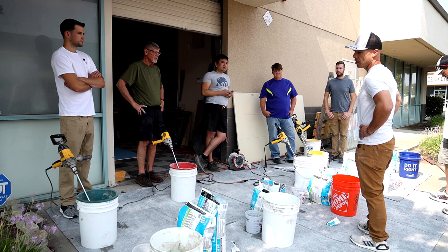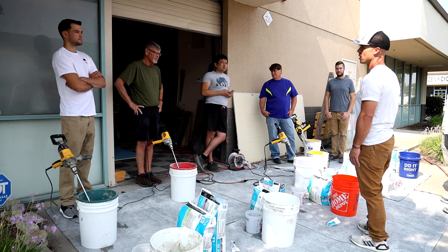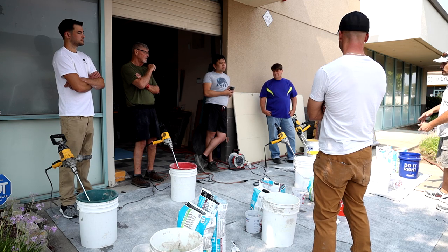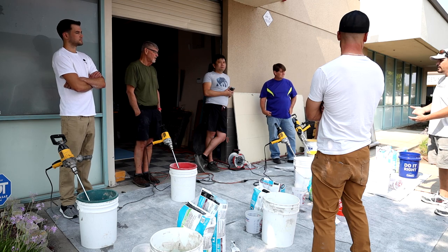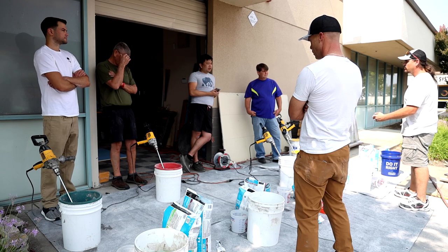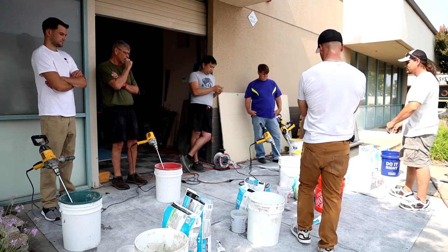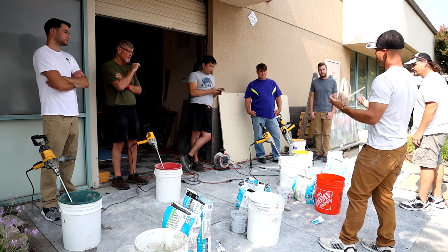This one might need more water — it's like baking bread. They all have different moisture contents depending on where you're at, so you have to do it by touch. Your goal is to only add powder to adjust. If you're on a job site and you put too much powder in, you can work some more water in with a sponge. Within that slake time is where you get to control your mud. You may need stiffer mud to build up a low spot or looser mud to compress over a hump and flatten a ridge.